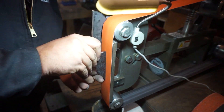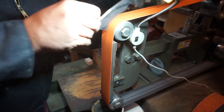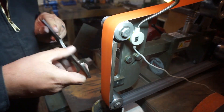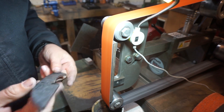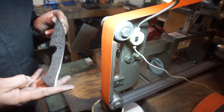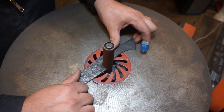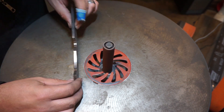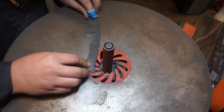One of the things I like to do is make all the grind lines run parallel to the blade itself. Typically when you refine the profile, all the lines start running perpendicular to the blade, so making them parallel makes everything a lot easier to sand out. Then on the oscillating spindle sander, we're using an 80-grit drum to get into some of the tighter areas you can't reach with the 2x72. This also puts a better finish on the outside and gets rid of some of the grinding lines from the 36-grit belt.